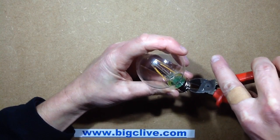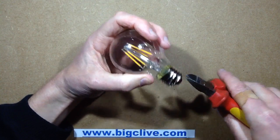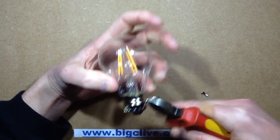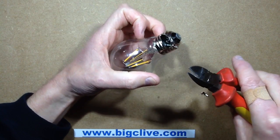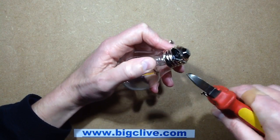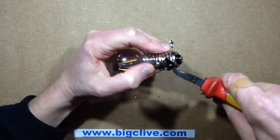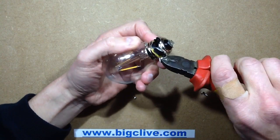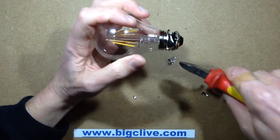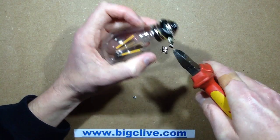Electron Update took one of these to bits and his had a switch on one side. I don't think there's much in this one. I'd kind of like it to be a capacitive dropper, but I've got an open mind — I don't know what it is actually. I'm seeing an electrolytic capacitor at the back, and I have to say this lamp had no significant flicker. This is looking very empty — I don't think there's a switch mode supply in here, but we'll find out in due course.